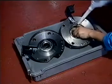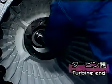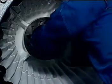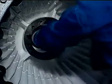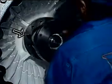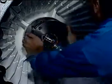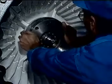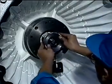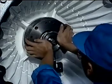Apply lubricating oil to the bearing and its holder. Align the guide bolt and positioning hole of the bearing, then install the bearing. Insert the centrifugal dirt separator. Then fasten with the ring nut.